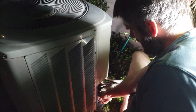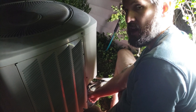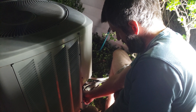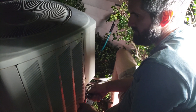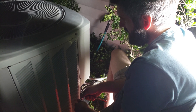The side's closed up. We can tell it's working because we can hear the compressor running. We can also feel how cold the line is, and we've checked inside and can see how cold the air is blowing out of the registers within the house. Quick fix — each of those capacitors was about $10 apiece and we got it all back in working order.